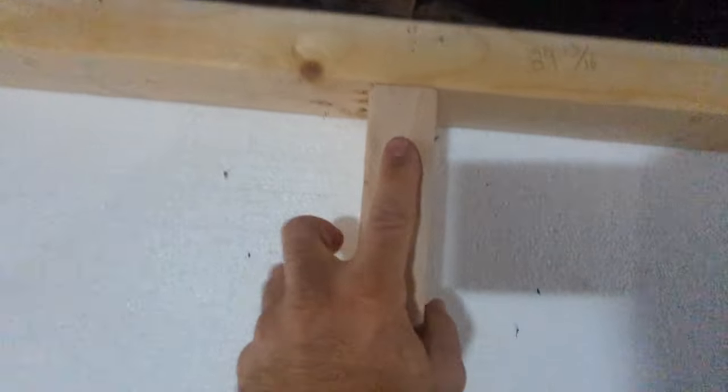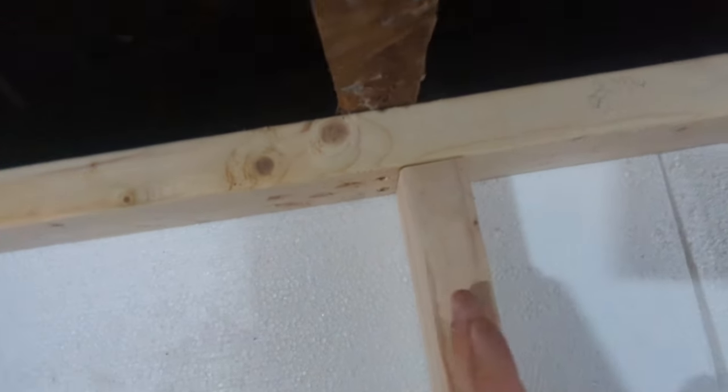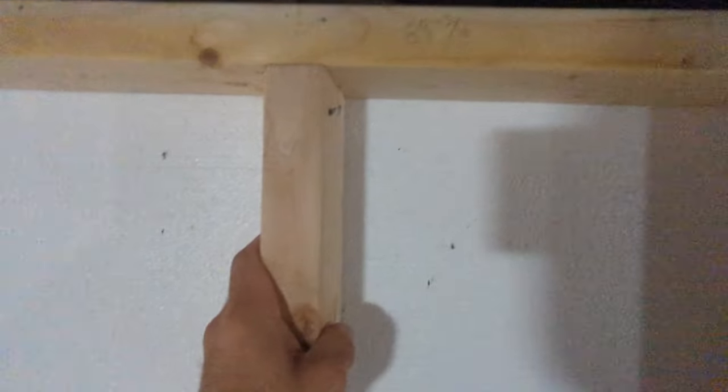And I'd like to think that the house is framed the way that it should, and the way that we almost get to here. This is a more perfect layout than this, but this started on this layout. And usually when you frame, you should have everything, the studs in a wall, underneath the joists, and the studs in the next wall. Everything's all aligned. So if you are using ductwork or anything, the cavities line up all the way up and around the house and back. If you stagger stuff, it starts becoming a real pain to do things like use hot air or forced air ducts and stuff. So starting there, that's the reason why we do that.